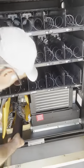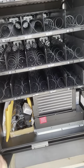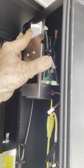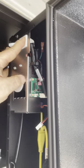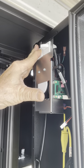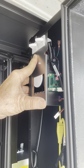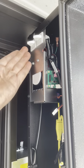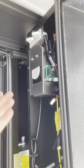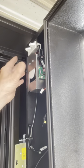When I had the door closed, the refrigeration was already running. There's your door switch right there — that's for the alarm. When the door is shut, the machine thinks the door is closed. When you open the door, that switch pops out and the machine knows the door is open. So if you're working on the machine and you hear it start to run, just push that in once and it'll stop.